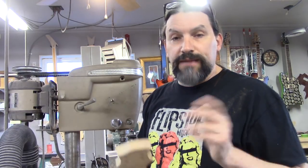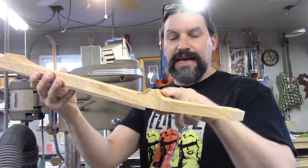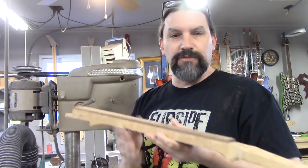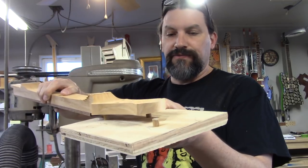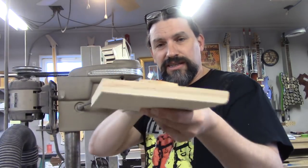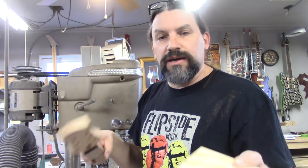The tuner holes haven't gone all the way through yet and the headstock isn't at its final dimension — it's going to be just over a half inch when it's all said and done. To do that we're going to run it through the old man machine, which is a homemade thickness sander. We use it only for headstock thicknessing. For these necks we put the necks in and sand this edge, which establishes our volute. We have a little jig with some pins in it and the necks fit on there and run through the machine.